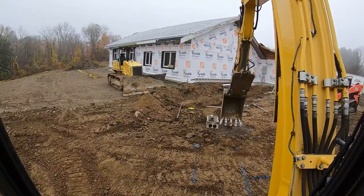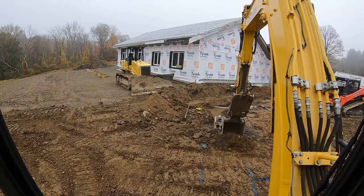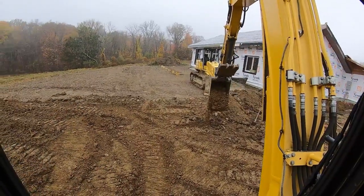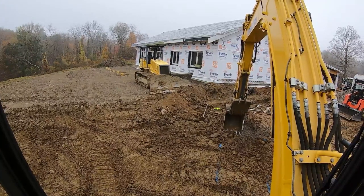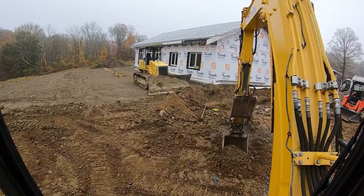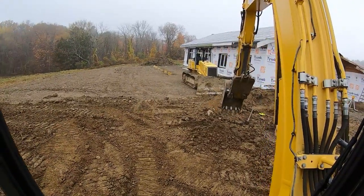So we're gonna keep the trunk a foot in the ground the whole way. Then we'll pull the laterals off of that afterwards, but keep your same distance of the foot. Gauge it with your bucket. It's not too critical. You're always gonna pad it up with some stone if you get a little too deep. You just wanna make sure you got enough.